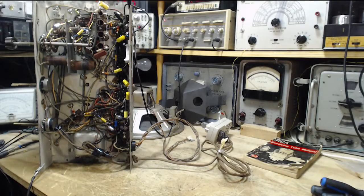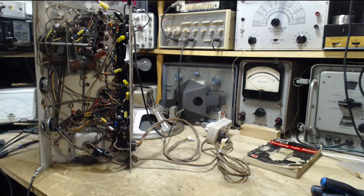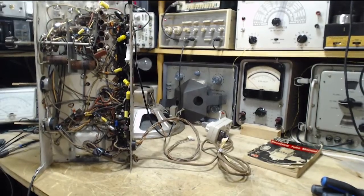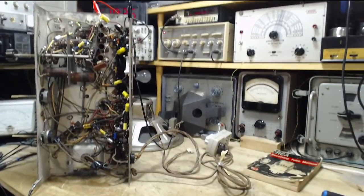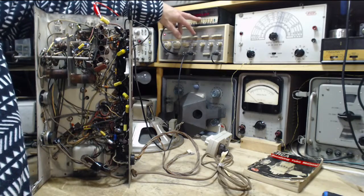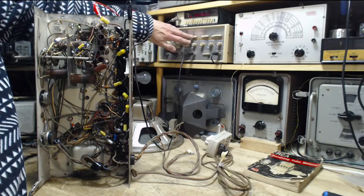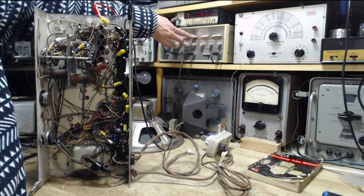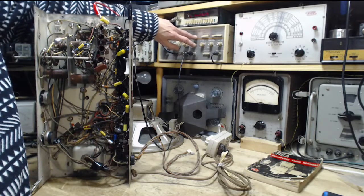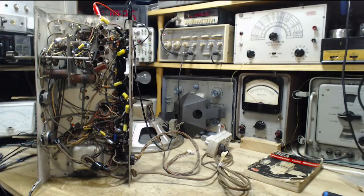Okay, here we go. So I have the sweep generator. It's sweeping something right now. Oh my gosh, I almost knocked the box of tubes on the floor. Yikes. Okay, so the sweep generator is producing a sweep. The center of it is right around a million, so I think it's, well, I can check. Starting at 505 and ending at 1628, so it's sweeping most of the AM band. That's not at all what we want. We'll adjust that in a bit.